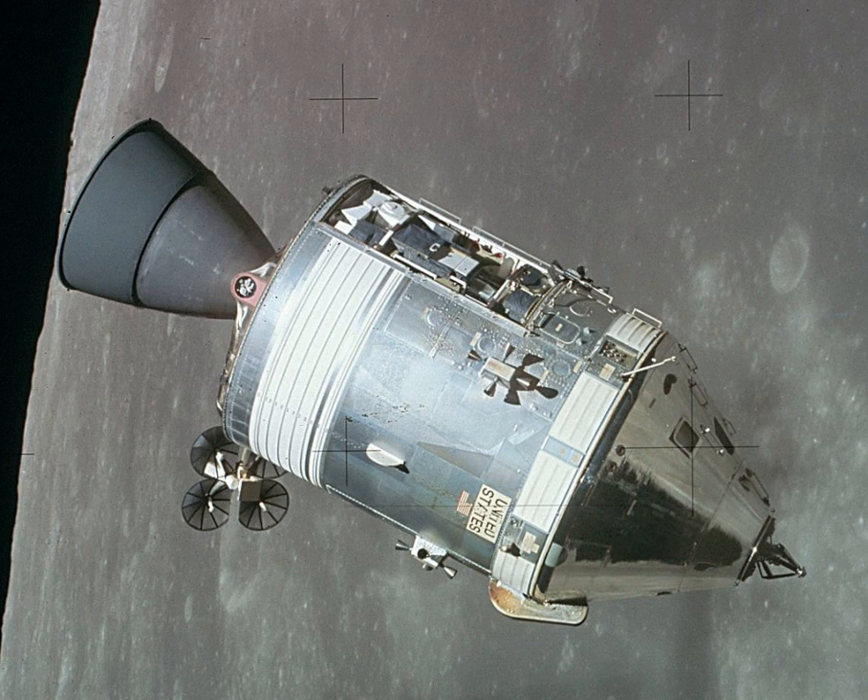On the flight of Apollo 13, the EPS was disabled by an explosive rupture of one oxygen tank, which punctured the second tank and led to the loss of all oxygen. After the accident, a third oxygen tank was added to obviate operation below 50% tank capacity. That allowed the elimination of the tank's internal stirring fan equipment, which had contributed to the failure. Also starting with Apollo 14, a 400 Ah auxiliary battery was added to the SM for emergency use. Apollo 13 had drawn heavily on its entry batteries in the first hours after the explosion, and while this new battery could not power the CM for more than 5 to 10 hours, it would buy time in the event of a temporary loss of all three fuel cells. Such an event had occurred when Apollo 12 was struck twice by lightning during launch.